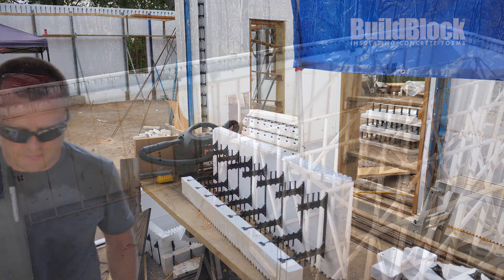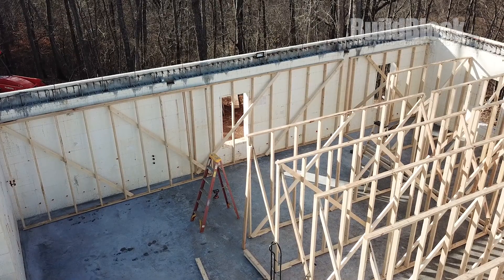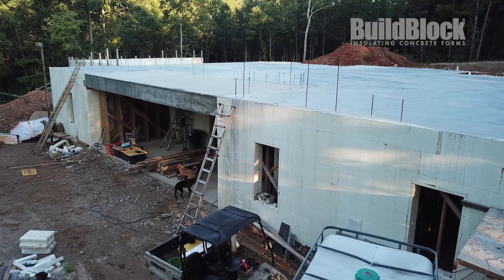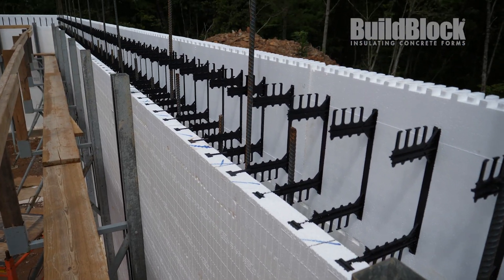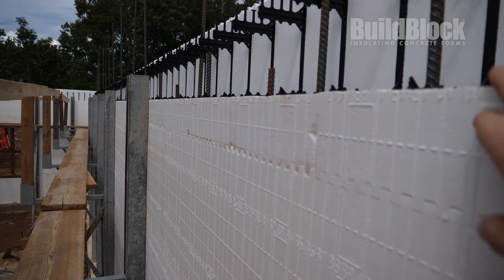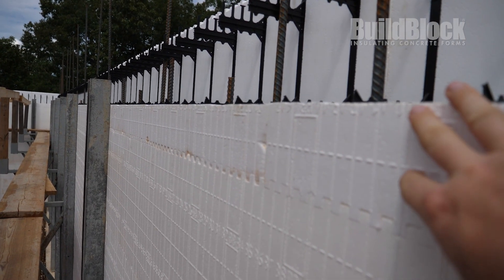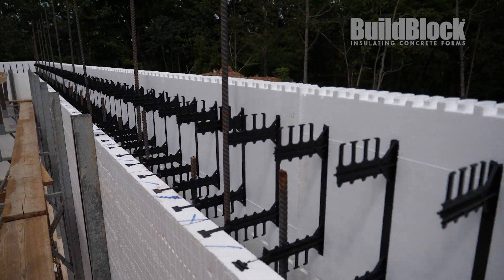Attaching it — that's an important part. In this house, the basement is going to be nine foot four, and then I'm going to have an eight-inch build deck poured on top of that. You can see I have seven full courses of blocks stacked here, and then the eighth course we've actually trimmed. If you look in with me here, you can see we cut this down to just four inches high right here. The build deck is actually going to set right on top of this.